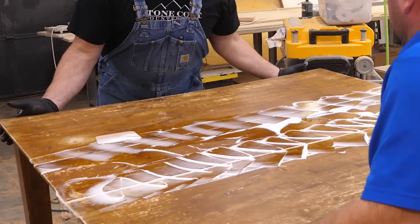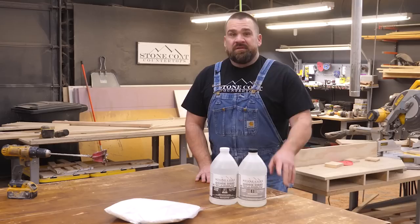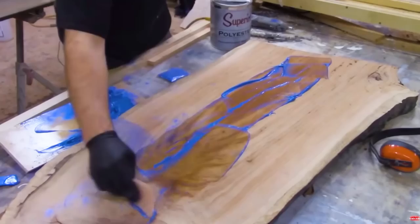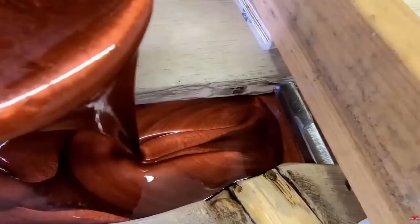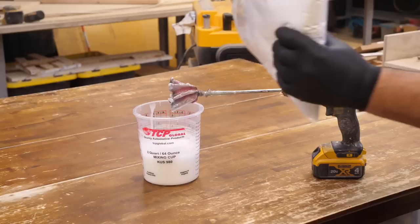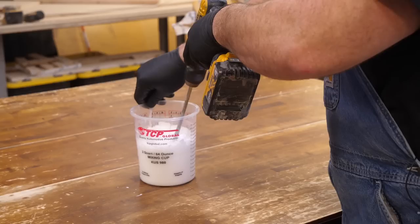To permanently install my table leaf, I'm going to use Quick Coat. Quick Coat is a fast drying epoxy at a one-to-one ratio — you mix for two minutes with a paddle mixer. You've got to work quick; it sets up in about 15 to 20 minutes. To extend Quick Coat's working time, mix and then quickly remove it out of the bucket. Start by pouring Part B first, then Part A at a one-to-one ratio by volume. Mix for two minutes with a paddle mixer. Add Stone Coat's Epoxy Thickener to achieve the desired level of thickness — usually 5% by weight of mixed epoxy. Mix again for another minute and now you're ready to go.